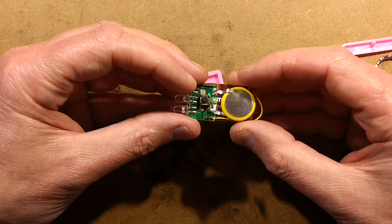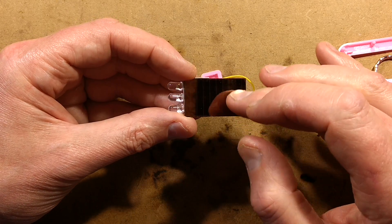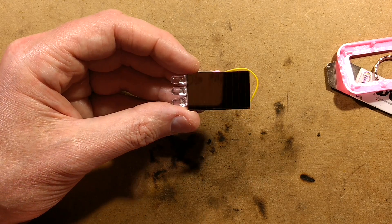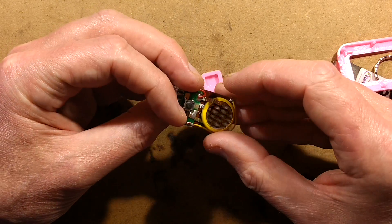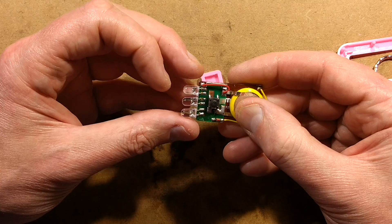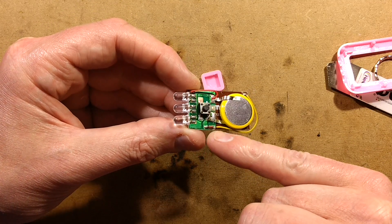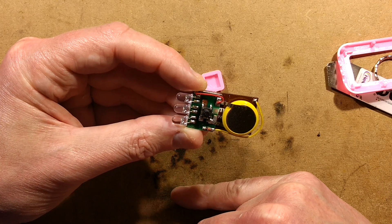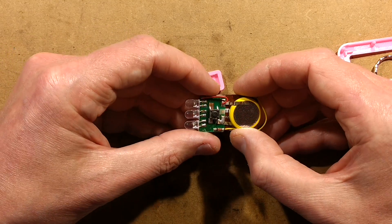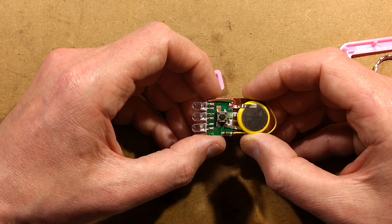What's the open circuit voltage this will put out? It's got one, two, three, four, five, six, seven, eight, nine sections — and a half section in there — so that's going to put out about 4.5 volts. Minus the diode gives roughly about 4 volts, so they might just be relying on that to avoid overcharging the cell. Likewise, I don't see any resistor here, so really the button is just shunting the LEDs straight across the cell. But it'll have a modest internal resistance, and the LEDs themselves will sort of start turning off around about the 3-volt downwards sort of area.